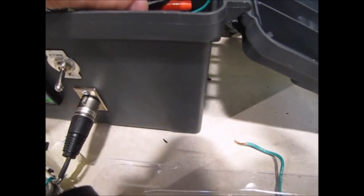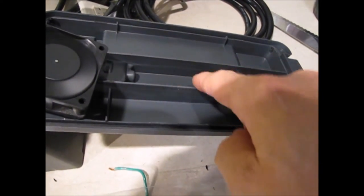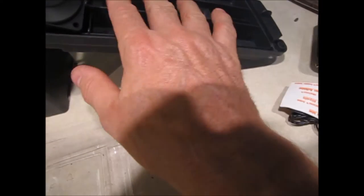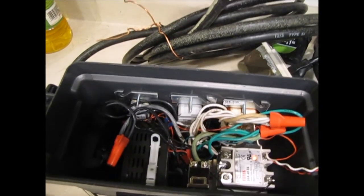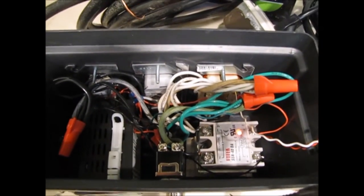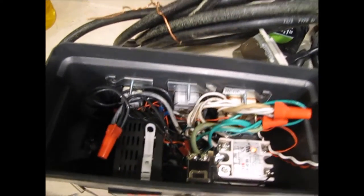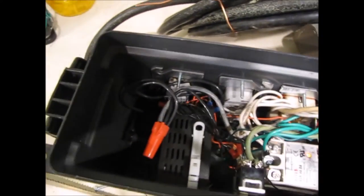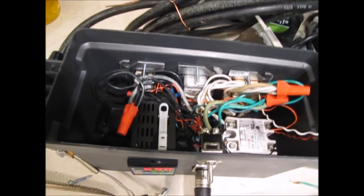It's going to put out enough air to circulate through the inside here. What I think I'm going to do is cut a notch right here and put the fan up on the lid, in this general area, so it'll blow air straight down, keep the PID cool, keep the SSR cool, and any excess pressure should go out through the outlet gaps in the back. If I have to, I may drill some holes on the sides to let off a little pressure and circulate air around.